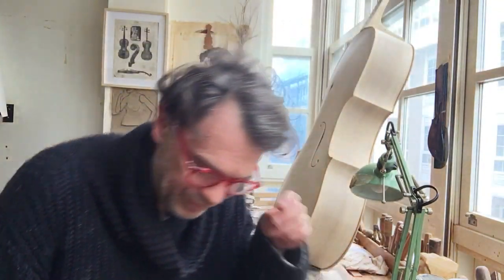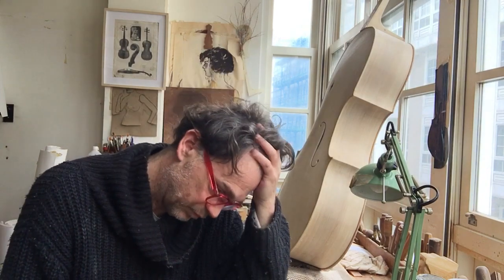We'll do the neck attachment video — it's a really complex topic, maybe two videos. The lesson I'd give you: if someone wants a baroque violin and wants a nailed neck, my advice is to not just nail it. What I do is mortise and use a nail or a screw — a viola da gamba attachment method with the shelf. I promise you that's not going to shift. Some luthiers say the nail rusts inside and makes it stronger, but I'll leave that there.